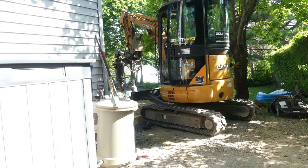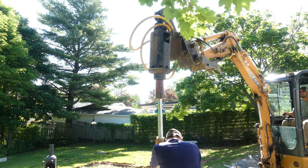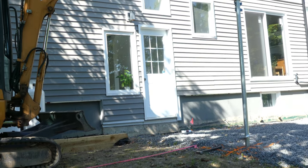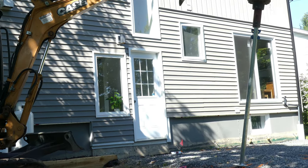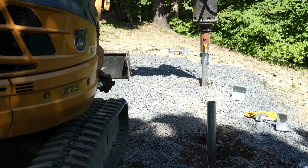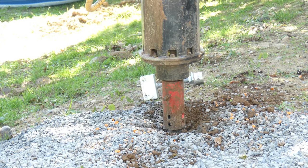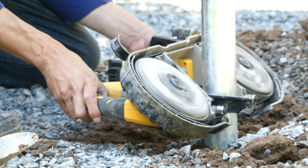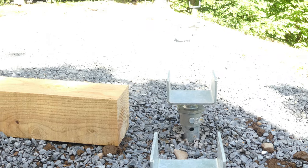Some of the most common applications for screw piles include piers, basement walls, perimeter beams, and even slabs. So keep in mind that as we're talking about helical piers for a new backyard deck today, this isn't the only application, but it is arguably the most common for homeowners to be familiar with. These piers can be driven into most types of ground, but solid rock does require some pre-drilling and will add to your cost. Stony soils are okay as well, but sometimes you might hit a large rock and have to start the process all over again and reposition the screw.